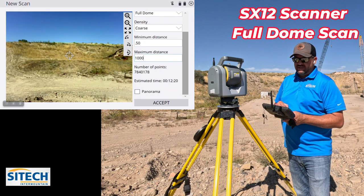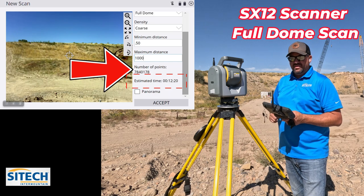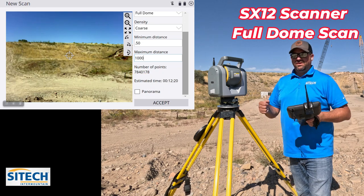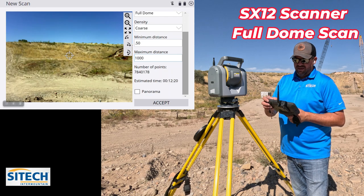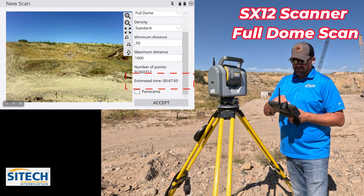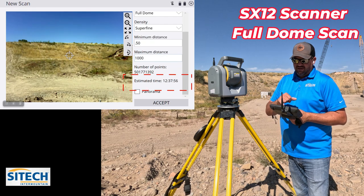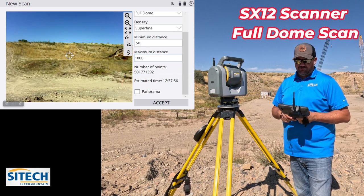And then the estimated number of points that it's going to take is going to show up. And then you've got an estimated time. This is the one to be careful of and watch if you're out doing a scan and you've got a meeting to get to or you have to be somewhere. If you notice that on coarse, it's only a 12-minute scan. If I put that density back on standard and leave all those numbers, all of a sudden it's a 47-minute scan. Let me show you something else. If all of a sudden you go to super fine, now it's a 12-hour scan. I don't think a lot of us have time for a 12-hour scan.